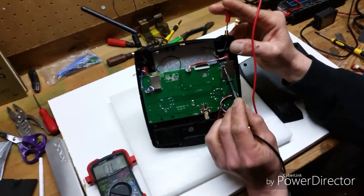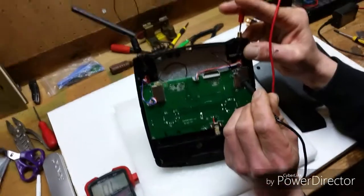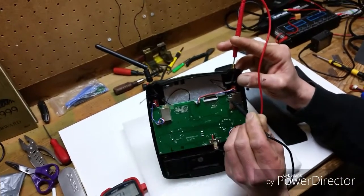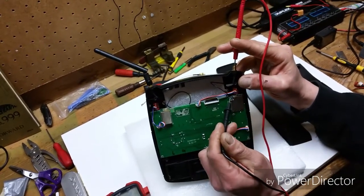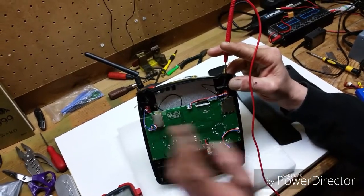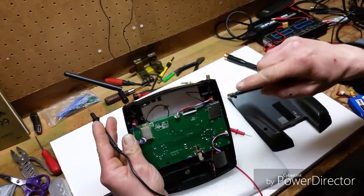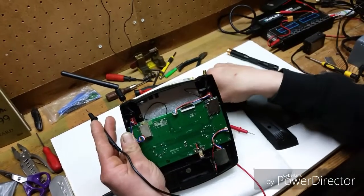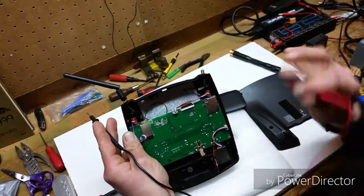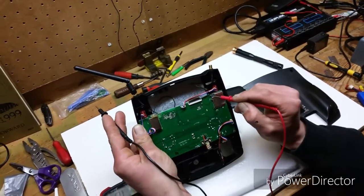If you're not sure on where to solder these, there's only one positive wire — that is where this UFL connector would have been, but since it broke off I had to split this open. You can use thicker gauge wire or even an entire antenna, cut the SMA off, and then split those and solder them the exact same way. This actually is a more solid connection, but it is kind of nice when you've got an IPEX or UFL that has four solder points and then one positive signal.